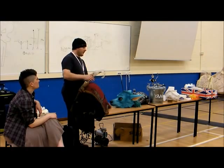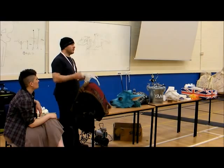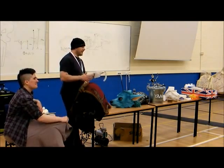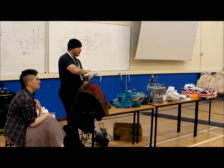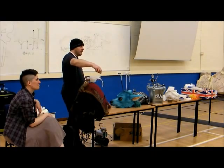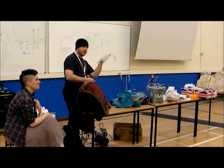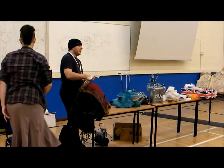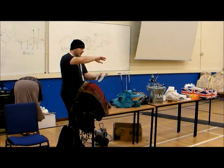So basically what I've done is on a big glass, you know, you get those glass chopping boards. We found one in a skip, brilliant for this, so I didn't even buy one. That's the best kind of thing. So I sculpted it on a plain glass sheet. I then made a little wall of clay right around it, so close to the edge, you can kind of see it. I'll pass this around for people to have a look at. So I've basically got a little reservoir with a little sculpture in, and then just poured silicone in.